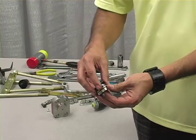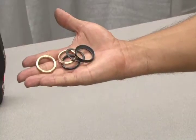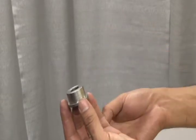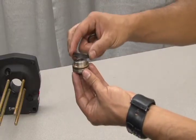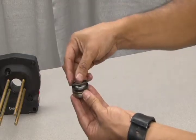Remove the used packing seals from the end cap and replace them with the new parts from your seal kit. When reassembling this section, notice that the surface of the end cap is concaved in. The seal parts also have alternating flat and concave surfaces and must be assembled in the proper order. Refer to your Haskell drawing for proper part number and order of the seals.